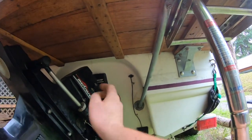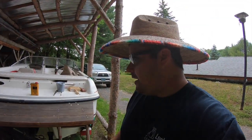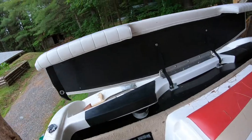The fun part — drilling into the hull. That was the hardest thing to convince myself would be okay. I drilled into the hull at a location where I could access from the back side, because I wanted to put backer plates. You can see the back of the bracket in there — that's the backer plate. I wanted to ensure there was adequate support on the hull, because when I get myself out on there, that's a fair bit of weight. I didn't want to just screw willy-nilly into who knows what.